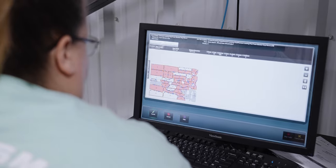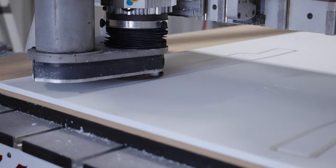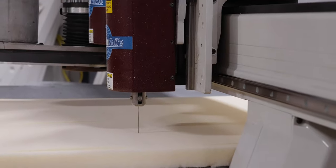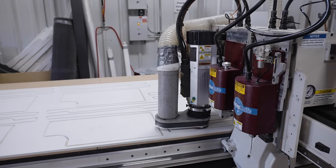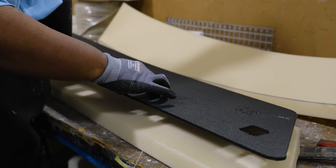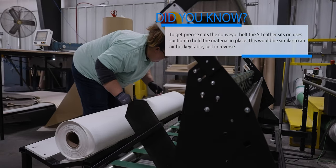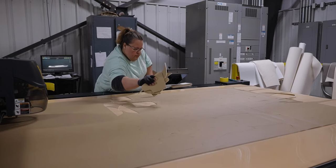Once design has been finalized, we move on to the production phase. Modern technology in our upholstery department has facilitated a 200% increase in productivity while taking our quality to new heights. Work begins with cutting and trimming all materials down to size using our state-of-the-art in-house CNC machines. The first machine cuts the substrate used across many cushions and also cuts precise mounting locations for every cushion. We use a combination of two materials for rigid cushions: a white PVC plastic for hard bottoms, and a black semi-rigid substrate perfect for cushions that require some bending, like bow bolsters. Our second CNC station pre-cuts all of the fabric from a long roll, minimizing waste by nesting parts closely together.